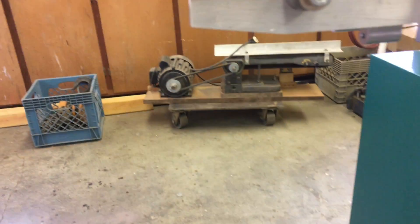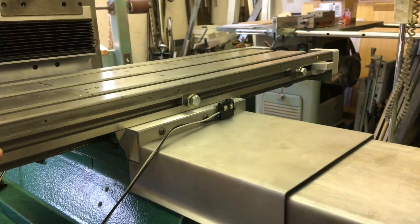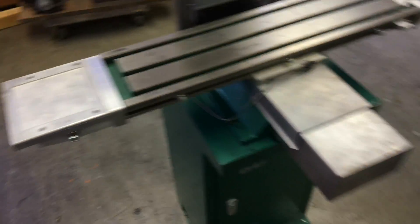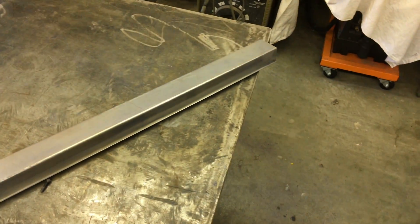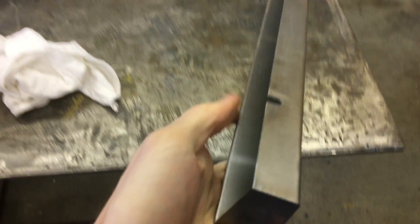Along the front of the table, there are bolts in this T-slot across the front. From there I made up a groovy gutter that spans the width of the table. It's a piece of 18-gauge bent up into a gutter shape with some caps on it. I've got slotted holes to drop over those corresponding bolts in the table, and then there's a notch for some adjustment of the limit switch trip. So we'll go see how that goes on there.